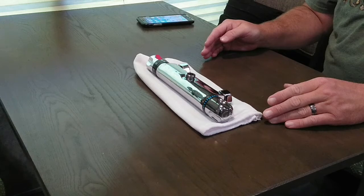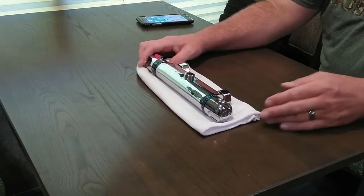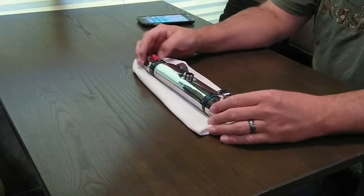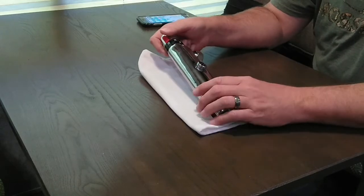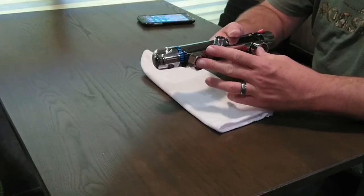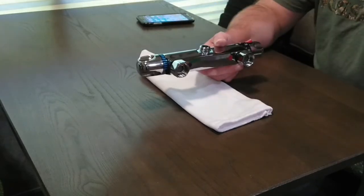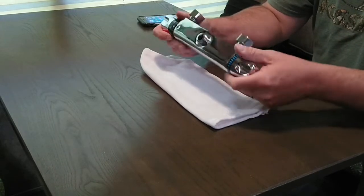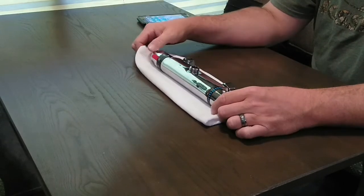One of the nice features about it is that you can set the hot temperature to what you want it to be, and it will mix the hot and cold and keep the temperature constant for you while you're in the shower. It is in Celsius, so you'll have to do that conversion. The way our shower is, this should fit in pretty easy, and our shower takes off from the top and fits on this. So other than the plate that we'll have to make and any of the connections in here, hopefully, fingers crossed, it shouldn't be that difficult.